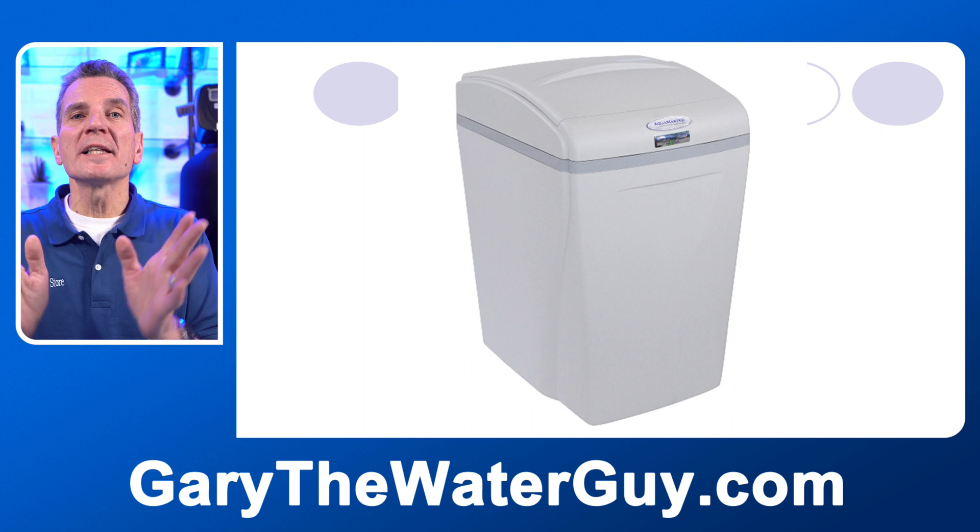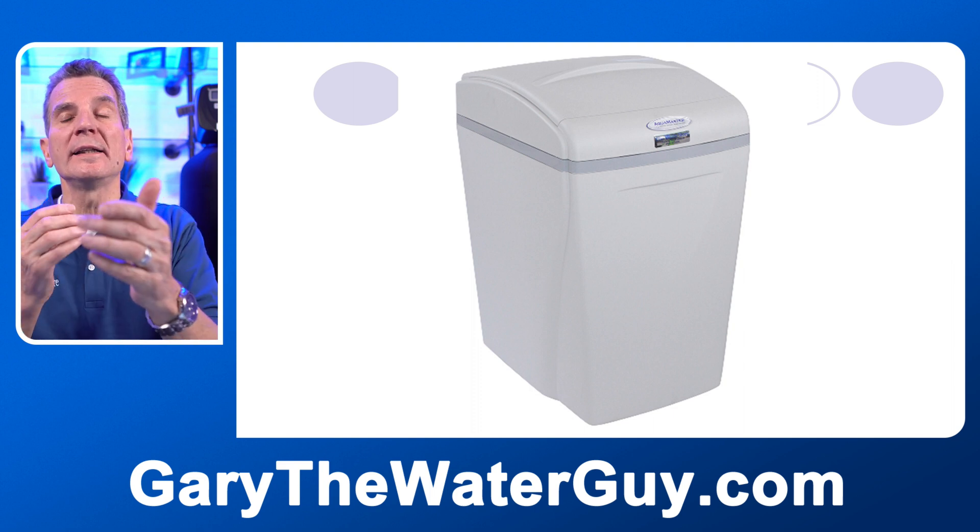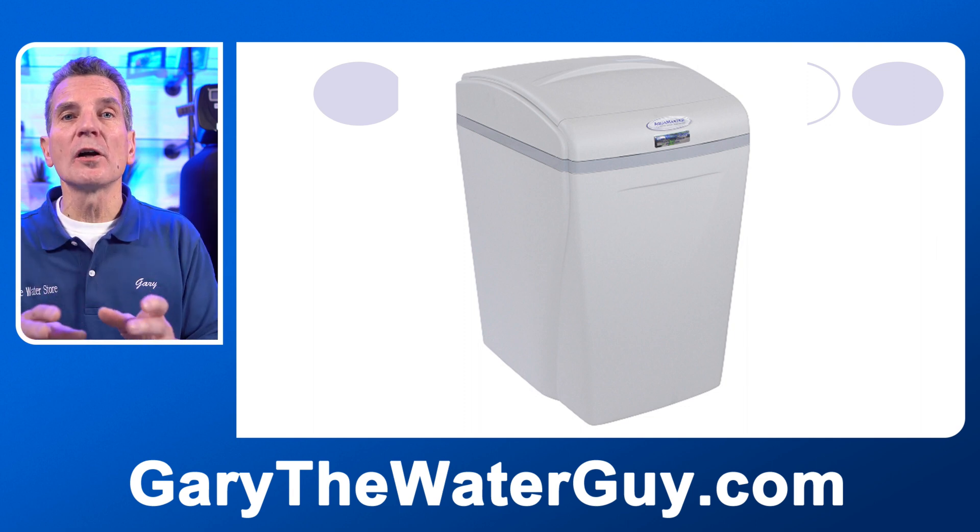If you're on well water, you may also have hard water. Signs include an off-white staining on glasses when water dries on them, or a white haze on glasses from the dishwasher — that's hard water. The solution is a water softener. Cottages and cabins often have very little space, so I recommend our AquaMaster water softeners — they're super small: only 27 inches tall, about 15 inches wide, and 19 inches deep. They're high-efficiency, meaning they use very little salt and very little water to soften.